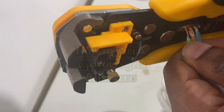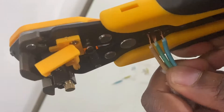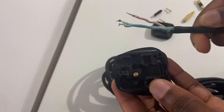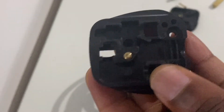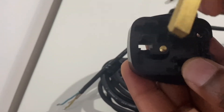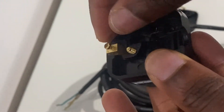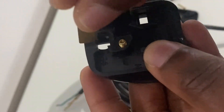If you want to see how to wire up your three-point mains plug, click on the link in the description. The next stage, having stripped the insulation from the naked wire, is to wire up a 240-volt mains three-point plug. I will need a thick wire that fits into the mains plug but doesn't need to be excessively long, so I'll trim it short. If you've got your three pins already inserted into your plug that's fine, but if not, insert them into their original positions.